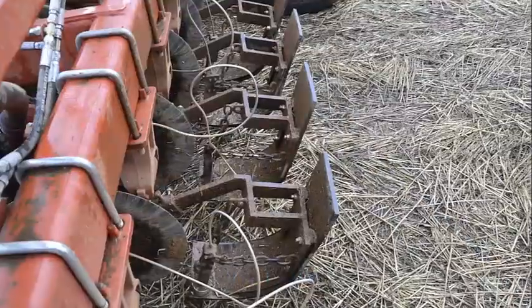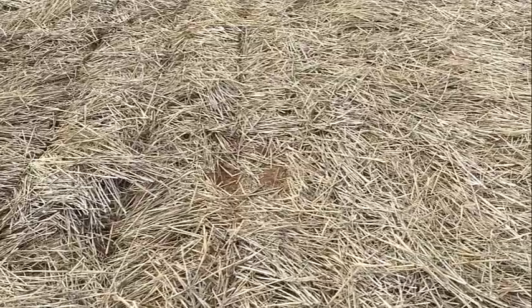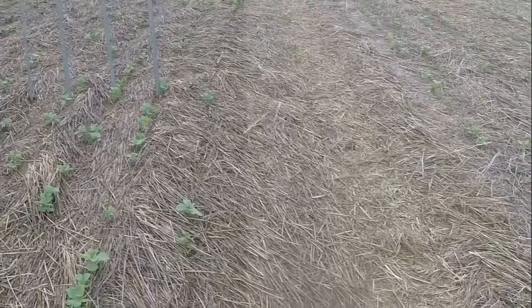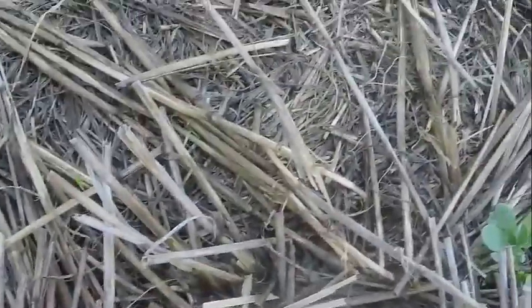This afternoon I'm in a paddock where we have used the AquaTool technology across multiple rows to see what the effect is in trying to seed into wet stubble conditions. The day we sowed here, the stubble was really too wet and normally the farmer wouldn't have sown. On that day, we put five stakes in the ground on five rows with the AquaTool technology, and then these rows over here are with the disc only. Looking at the areas that were sown without the liquid coulter, we see significant amounts of hair pinning.